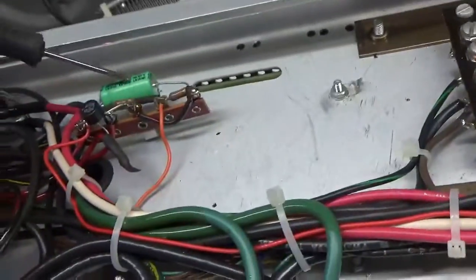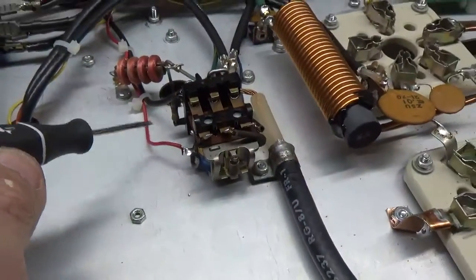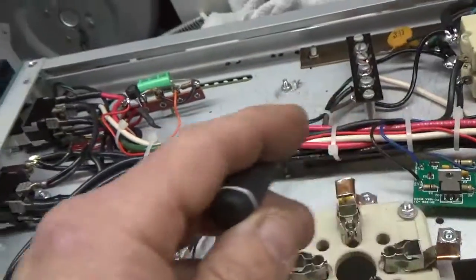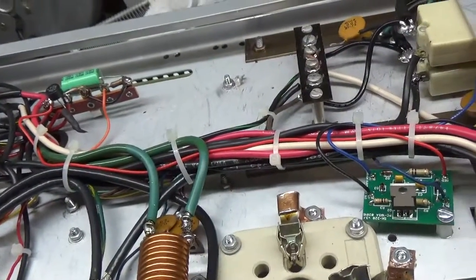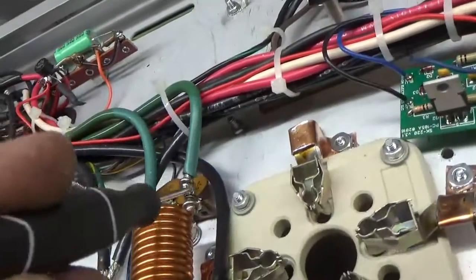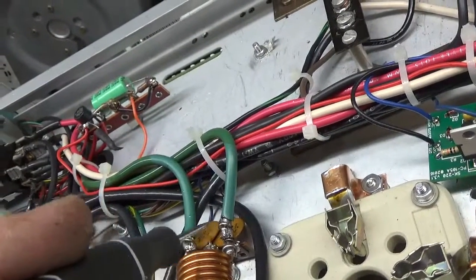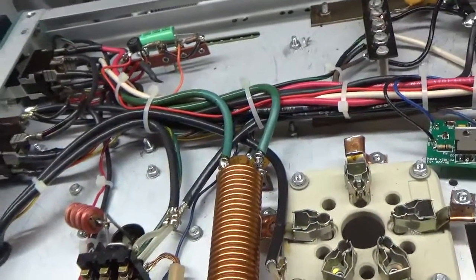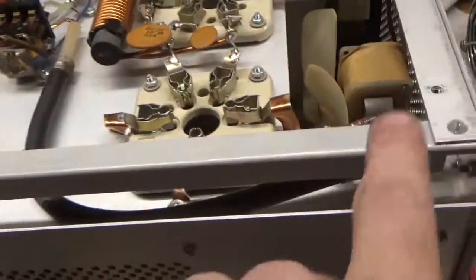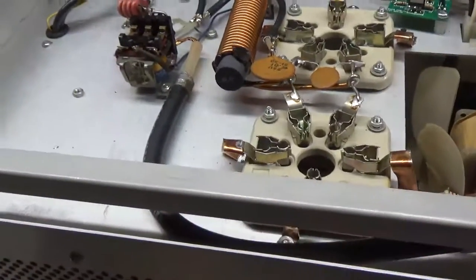New electrolytic cap. Got rid of the wire that was soldered here for whatever reason. Did the bias modification. Re-soldered the center lead for the output coax to the relay — had a bad solder joint. Re-tied everything. I think that's about it for the bottom. Also, bad solder joints over here — they just barely put any solder on — so I made sure I got the entire conductor and soldered it really well. I'll flip it over and show you the top, and clean the relay with Deoxit. Reinstalled this bar to change the connector and to ground this pin on the socket for the grid connection — I always remove this.